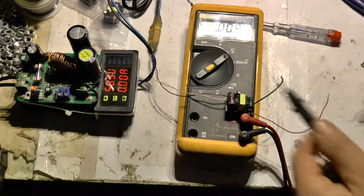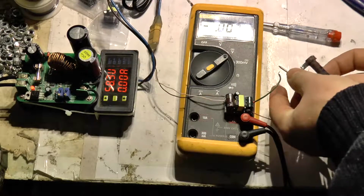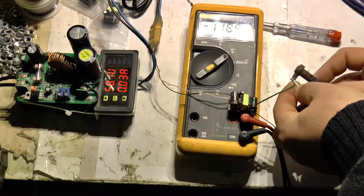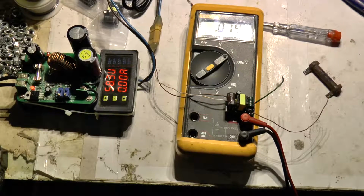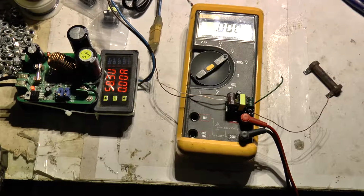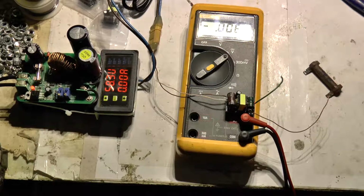So this is my off-grid full battery voltage. Let's see. Yeah, almost no drop. It's about 3 watts or something. So for a motion detector it's perfect. For a 12 volt motion detector to use in my home lighting system.